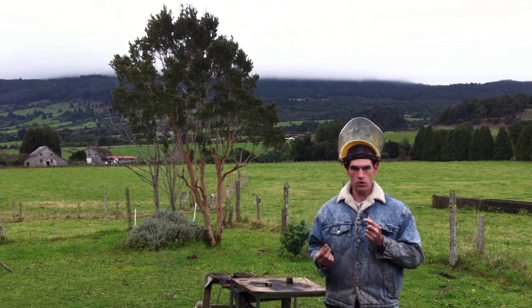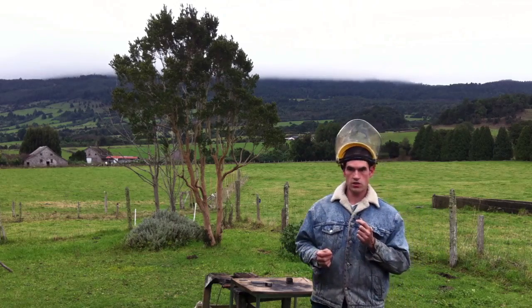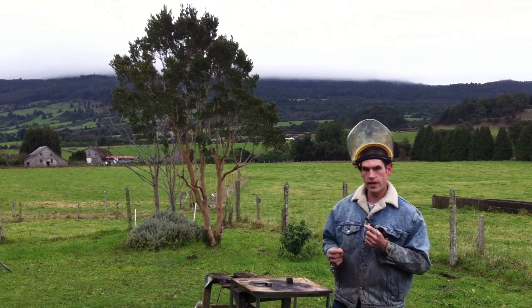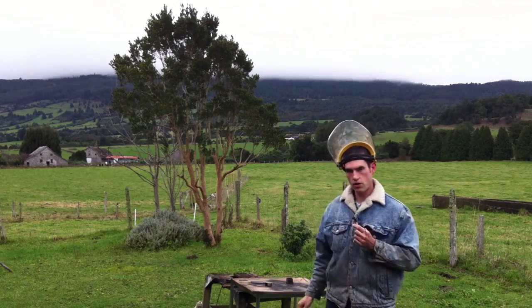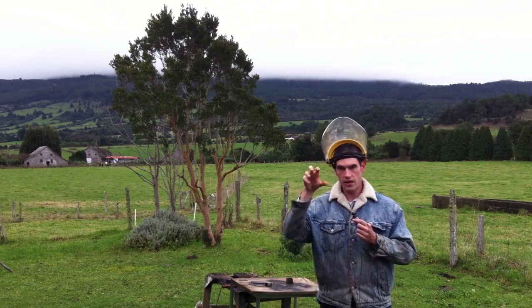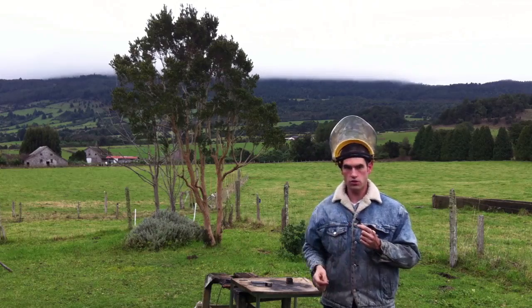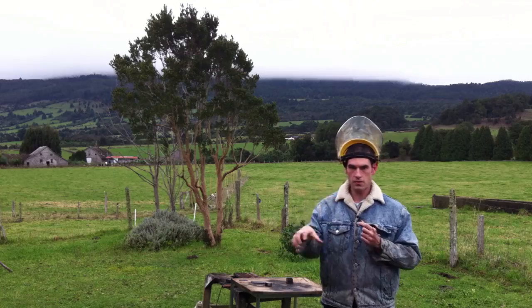I went with a 3mm wall 2x2 metal tubing, which is just over an 1/8 inch thick. And then I also went with a 6mm, which is just under 1/4, that'll go down the spine. And then the wood will actually have a recession routed out of it in the center that sits over that spine, and then it'll be bolted to the metal spine from the bottom up to make sure that the handrail is stiff.